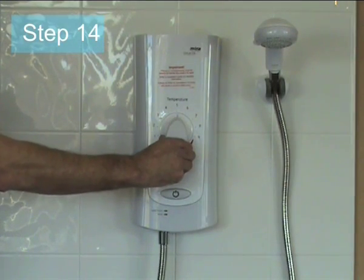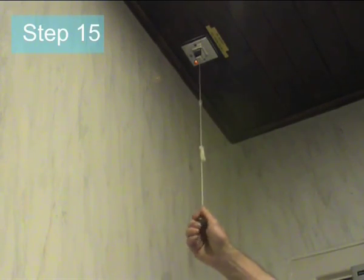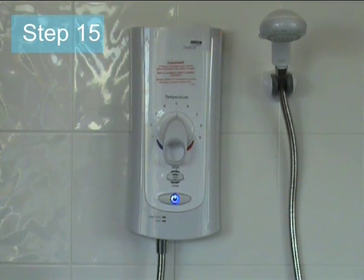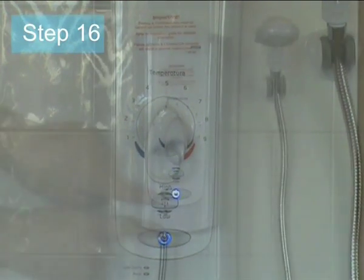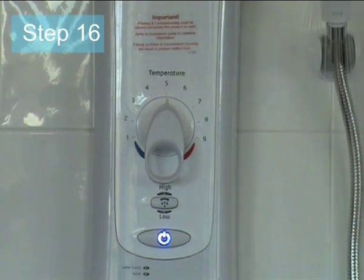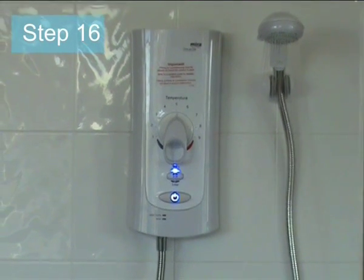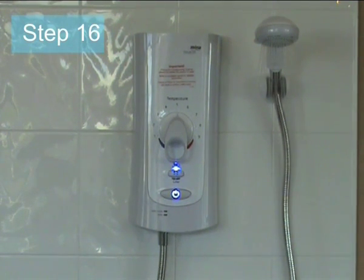Step 14: With the power off, turn the temperature lever to the chosen set point. Step 15: Turn power on to the unit using the double pole switch. Commissioning must be started within 30 seconds of turning on the power. Step 16: Press and hold the flow and start/stop buttons together. On the first bleep, release the start/stop button. On the second bleep, release the flow button. The unit is now commissioning itself — this takes approximately two minutes. Note: the outlet temperature may reach 44 degrees Celsius during commissioning. Do not interrupt the cycle unless the reset light turns on.